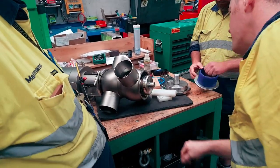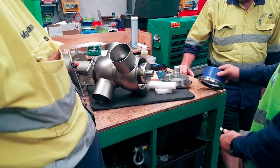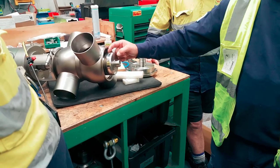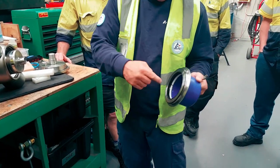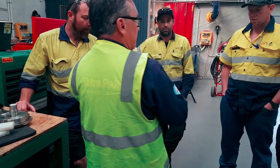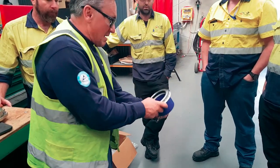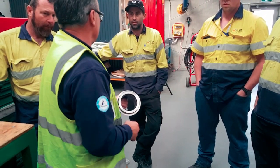You've got to remember that these are balance plugs, okay? They come down onto the seal. And so if you start putting dings and nicks in them, you're going to get nicks and dings in there, and you're going to start dragging out your guide strips, which is what Luke was talking about, the guide band in there. Leave it. And if anything, open it up, put a bit of lube and just push it in with your finger, and it'll just keep it parted.